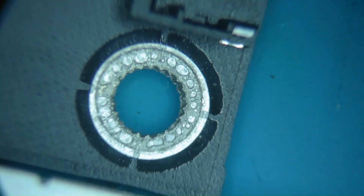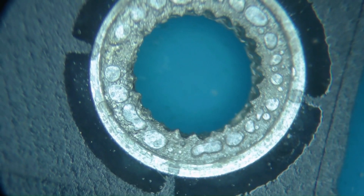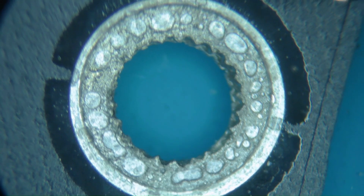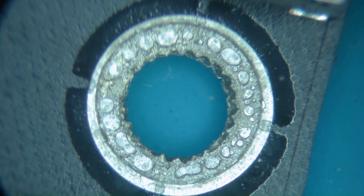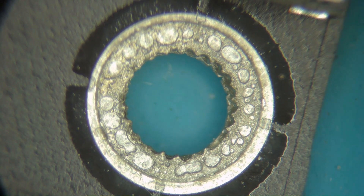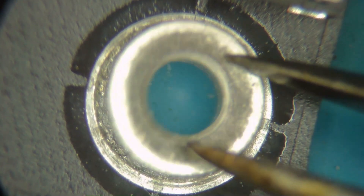I think it's a good idea to have this little metal ring here, except the soldering was not good on it. Look at the soldering on this thing — look at all the air holes, all the voids that were in the solder when this thing was put together. Having all these voids in there, having this bad solder, just let the thing pop right off the board. This is the sixth one I'm doing — the last one I have to do on this board. Six of them came off in different areas.